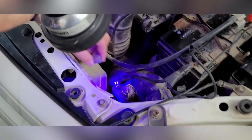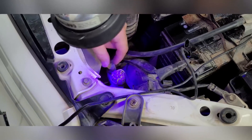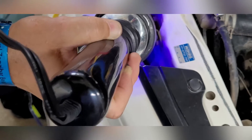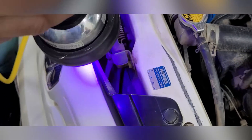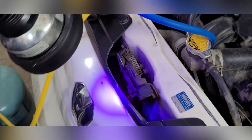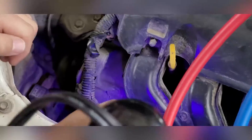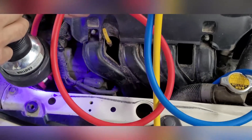You can already see inside here that it seems to be fine. You can look at the condenser from the front, and it seems like the condenser does not reflect anything. So we go to the compressor and check if the compressor is leaking anywhere. From the top we cannot see anything — the compressor seems to be okay, and the pipe here seems to be okay as well.